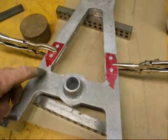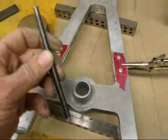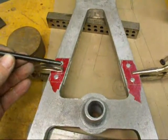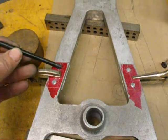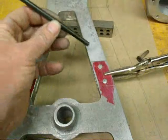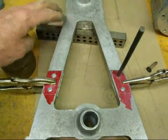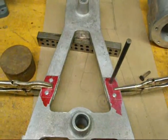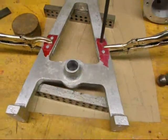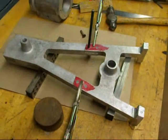I have drilled the holes in one piece, vice-gripped them together, and now I'm going to use the transfer punch — which I've shown you before — to transfer all four of those holes. I'll hit this with a hammer, then take this piece over to the drill press and drill them out 13/64ths, and then tap them. Then it's ready to screw together and it's starting to shape up so you can at least see what the thing looks like.